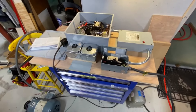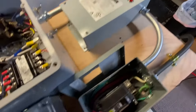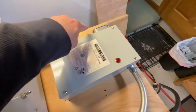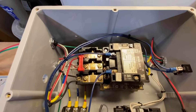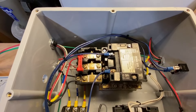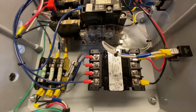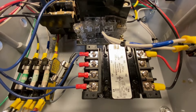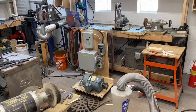So: power flows in here, through the Phasematic which generates the third phase, through the contactor, wires go down to the motor. The generated phase gets it started; once the motor is up and running I switch out the generated phase from the Phasematic, and then the motor itself generates the third phase, which is carried through these fuses out to the two outlets. One other quick note on the transformer: one pair of wires coming out of the 220 breaker routes through the conduit and ends up at this transformer. This contactor has a 120-volt coil that pulls it in via the switch, so the transformer takes in 220 volts and puts out 120 volts to pull that contactor in.